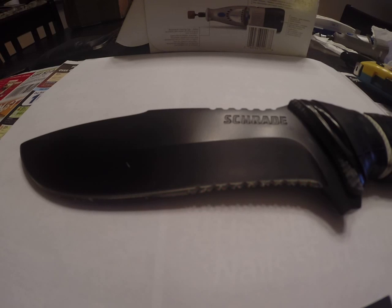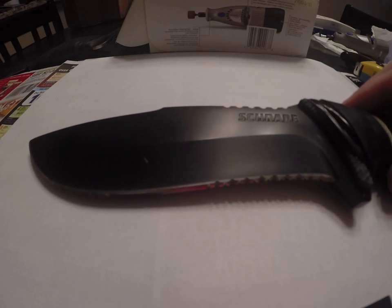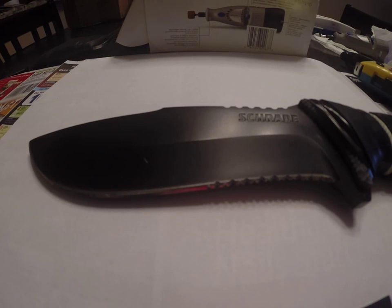There's two camps as far as people who like them and people who don't. But again, we're talking about a partially serrated blade. So we're talking about an inch and a half or so of serrations at the base, and you have the rest of the plain edge, which you can still use. So you really are getting the best of both worlds. Now, I don't have a lot of serrated knives, so I've just done it to a couple. It turned out really well. It's really effective. Serrations are great for cutting rope and for even sawing various material. It saws really well. So if it's something that you decide you want to add to a knife and you have the tools to do it, just continue watching this video, and I'll show you one way to do it.